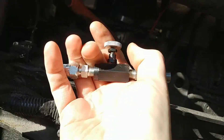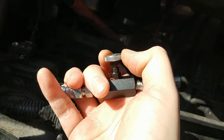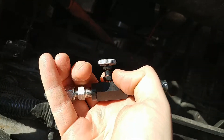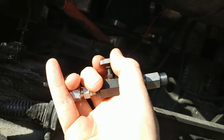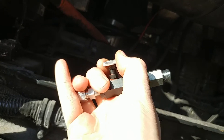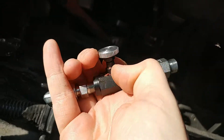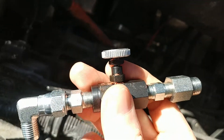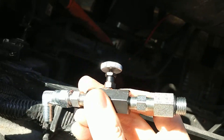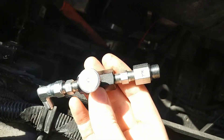I'm going to put a little oil on these threads before I torque them down. What this does is you can screw this down to close the valve — or rather make it smaller — and this will make the fan come on. Screw it all the way down and it runs full. Once we get it set to where we like it, there's a little nut to lock it in place so it's always set. It's very analog, very old school.